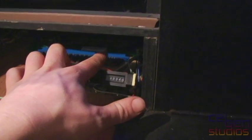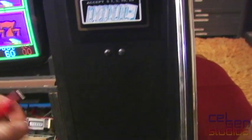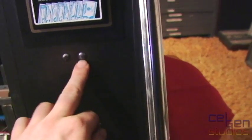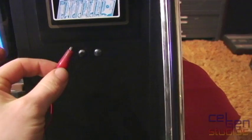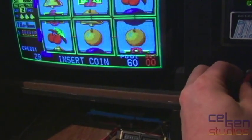It says 'insert coin,' which gives a bit of an option — maybe it'll take coins. Yes, it does. There's pin 8 down here, and all you have to do is ground that. I've added this little red lead here. These two bolts here aren't mounting points — they're wiring standoffs. This one here is for ground, so all I have to do is tap this against the ground bolt and suddenly I have credits coming out the wazoo as long as I keep tapping it.